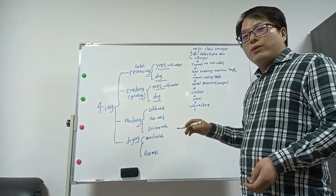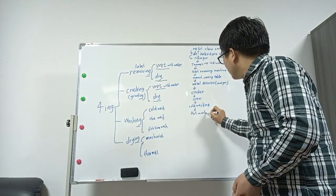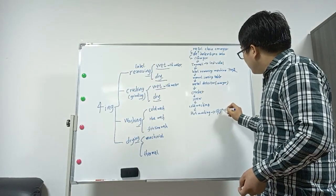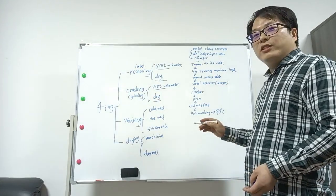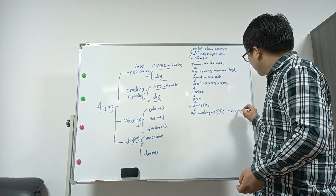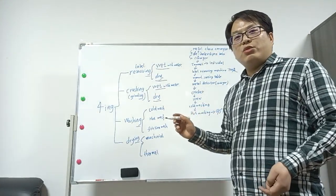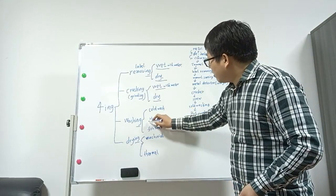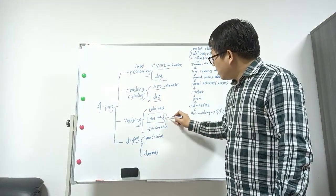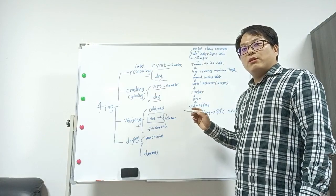After cold wash, we have the step of hot wash. In hot washing, we need about 90 degree hot water, with the caustic soda, or you can use other types of cleanser. The function is to remove the oil and dirt, because the hot wash is almost the most powerful washing step. So it needs a cleanser to make the flakes better.